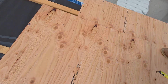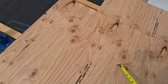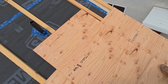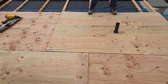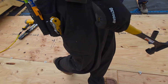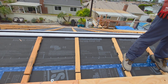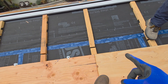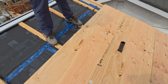There's a low line and a high line. It just doesn't look tall enough to me, but I'll cut that out and then we just slide it on and let it come down — hopefully that will work. Got that cut — perfecto. Then what we'll do is use this blue Tescon Vana tape and wrap it around there to make that airtight and watertight.